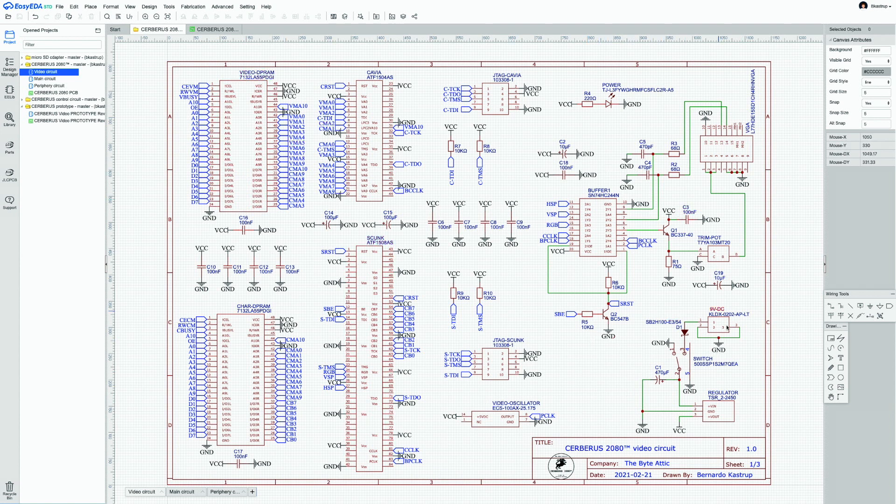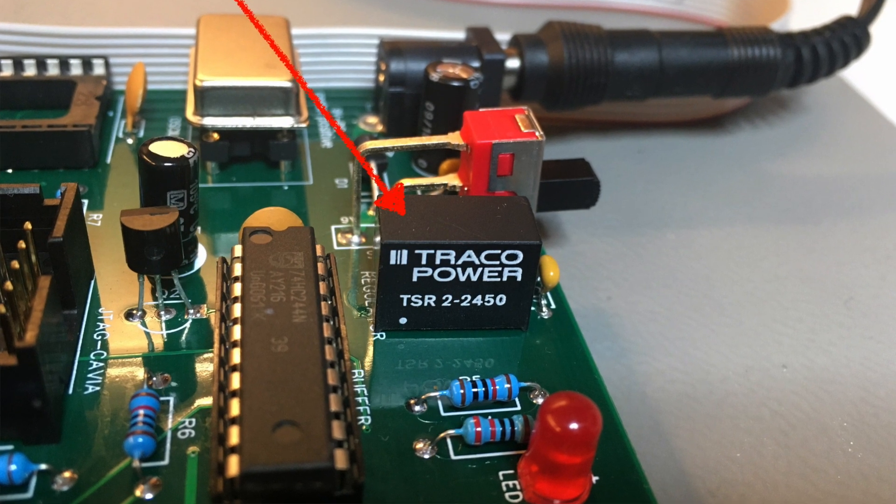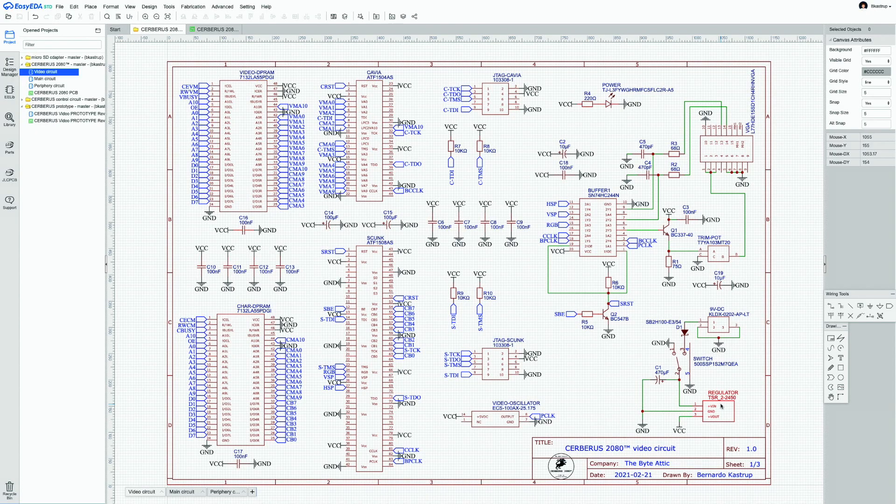The rest is what was seen before. On the bottom right, a switch mode regulator — also called a DC-to-DC converter or buck converter — was chosen instead of a linear regulator. There was some concern that switch mode devices could add ripples to the VCC rise and break the monotonicity required by the CPLDs, preventing proper power-on reset.